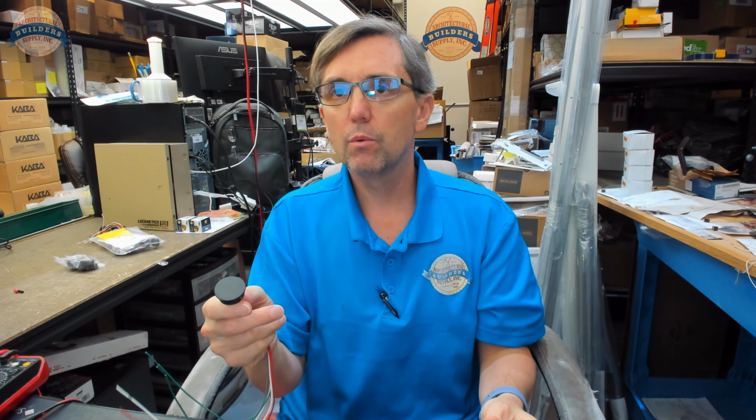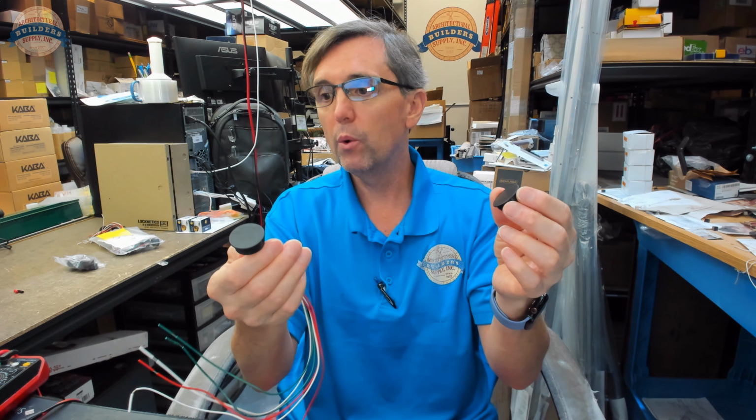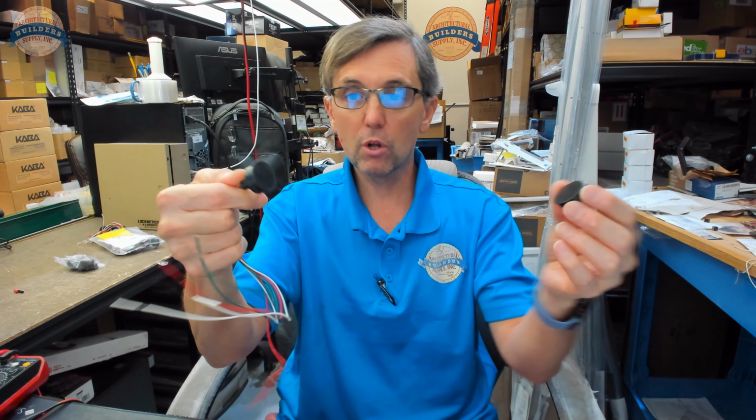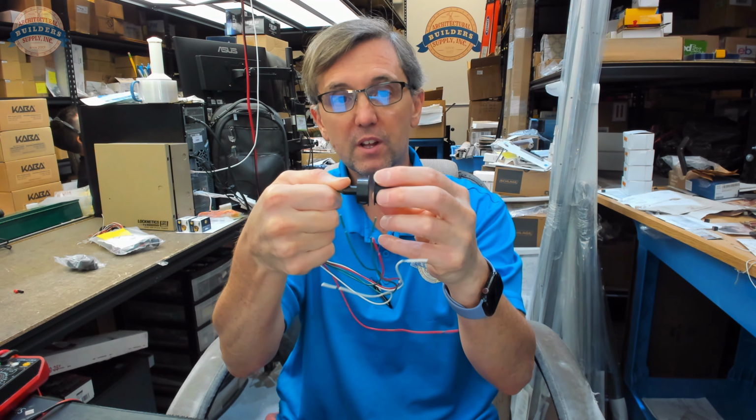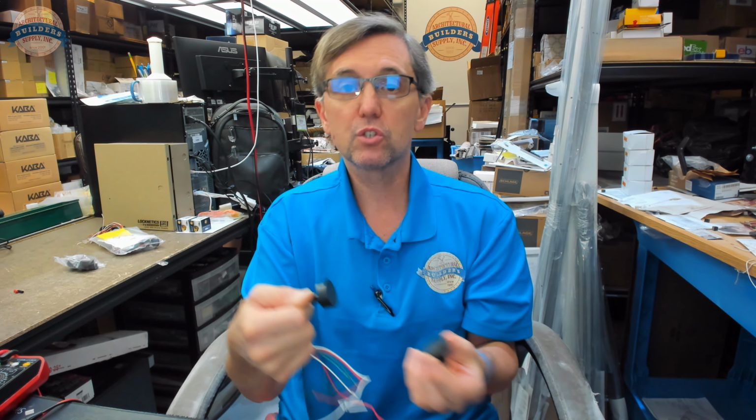So whatever switch he has, it sounds like it's single pole, single throw, but it would be either a closed loop type or an open loop type. He needs the opposite of whatever that 833.89.059 would be. And it sounds to me that that switch type would be called an open loop type, such that it's normally closed. Meaning when you take the hardware out of the bag, there's continuity between the leads. So electricity will flow when it's normally closed in this scenario, until you close the door and bring the two parts of the switch together, it will then open the circuit. It'll open the electrical configuration of the door position switch. Opening the circuit, electricity can't flow.